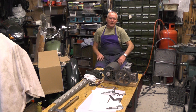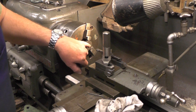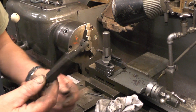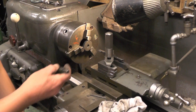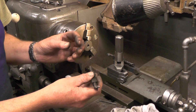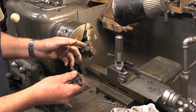So I'll take you over to my lathe and we'll have a look at how I'm going to do this. Depending on what size hole you're going to put this keyway into, it'll depend on what size bar you're going to use. So you choose a boring bar of a suitable size that's going to fit in the bore, and then you've got to put your tool sideways on — make a tool to the correct width of the keyway that you want to put into that gear, in my case.